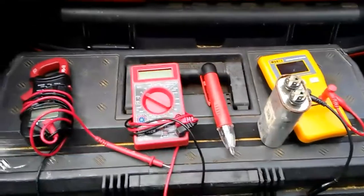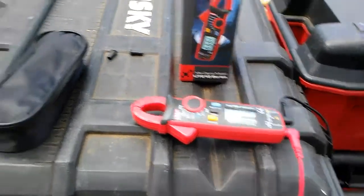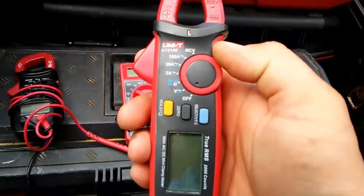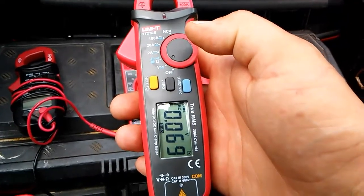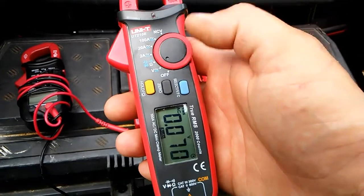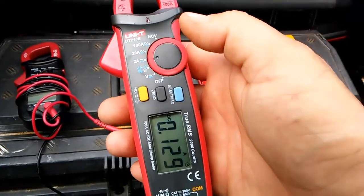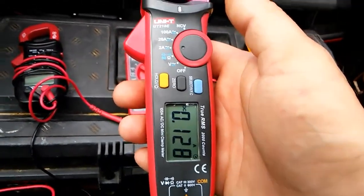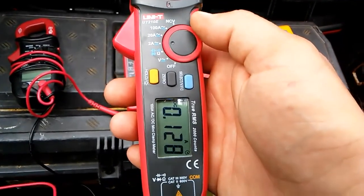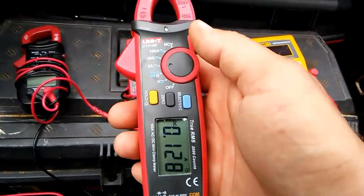These are the little smorgasbord of stuff that I carry. For $32, this replaces all of them. It does fine readings for voltage — AC and DC — and it's auto-ranging, or you can manually set it. The amperage draw does AC and DC as well, which is nice because you can go to Home Depot and buy a $100 meter and it won't read DC load draw. So having AC and DC load draw in one meter is pretty cool.